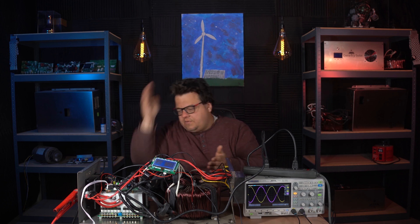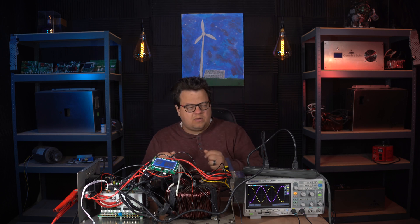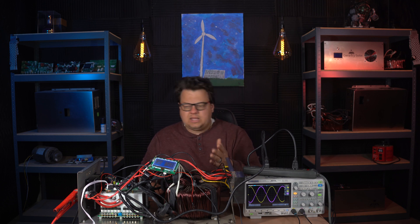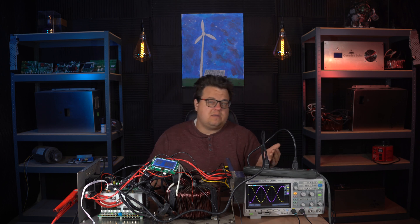This is great for emergency backup in a pinch if you don't want to have to rewire just so that you can get your lights on — because half of your lights are on L1 and half are on L2. If you're in an emergency situation, you can have a backup generator that's set up and ready to go at 120 volts that will give you 240 volts split phase out. Just keep in mind you're doubling the voltage, so it's going to be twice as hard on your generator. You're going to need appropriately sized wiring and appropriately sized breakers. The inverter is capable of giving you 240 split phase on the output even if you have 110 volts input.